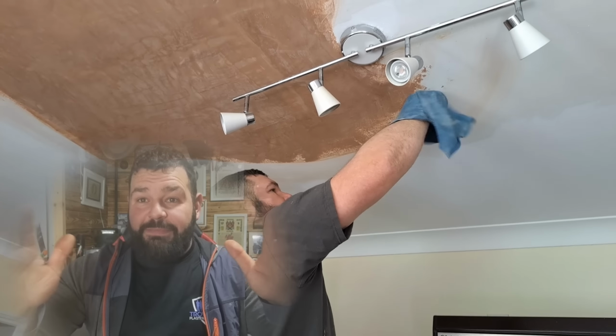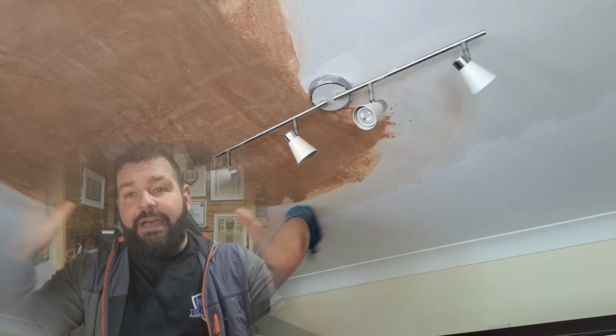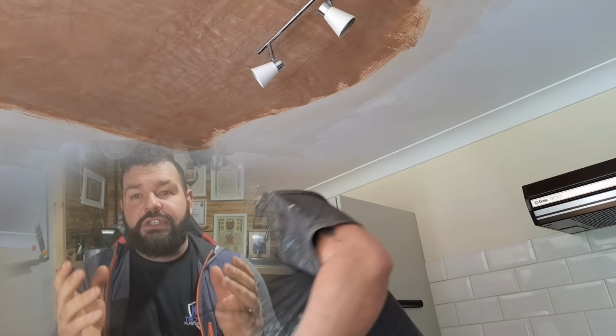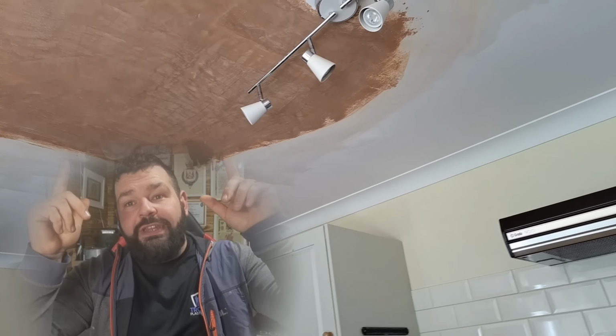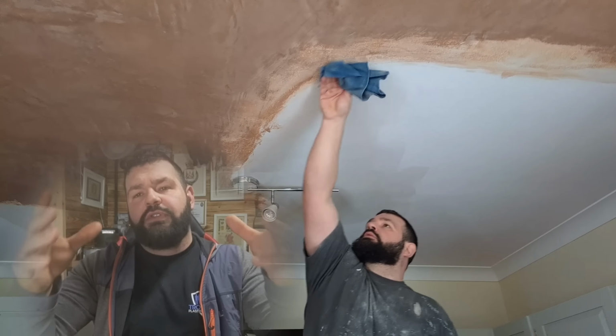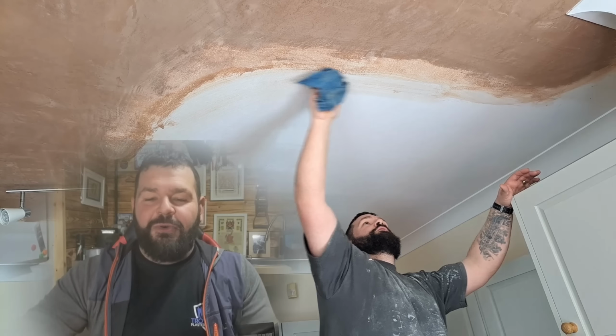Upstairs in this house where we make the plastering, it's all tiled, all the floors are tiled, in the bathrooms, the en-suites and everything. So a lot of the work that the plumbers and the sparks have had to do, they've had to do from underneath the ceiling, so they've cut holes in the ceiling. And the builders have them really take the time, cut the squares out neatly with a multi-tool and keep each piece and number it so it can all go back in the same hole.